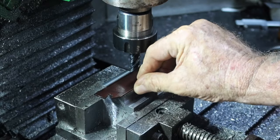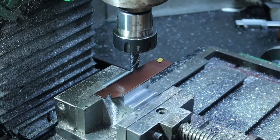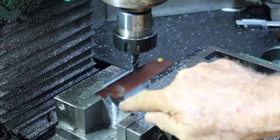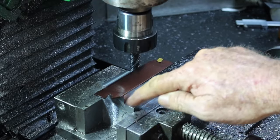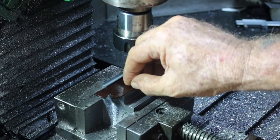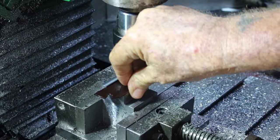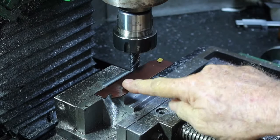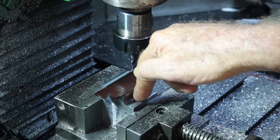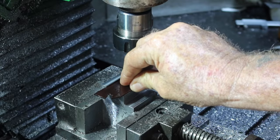That's almost the machining done on this side. There's one thing left to do tomorrow morning - I want to machine a little V down into the bottom corner in here so that it sits just a little proud of the top, so you can clamp it down. The little V in there will help pull the clamp plate down this way and clamp the thing solid in there, but that's a job for tomorrow.